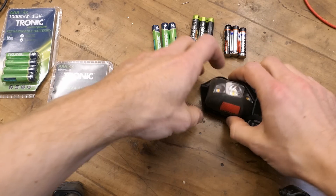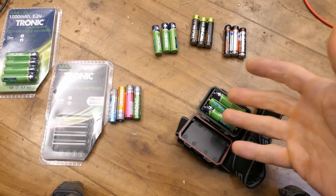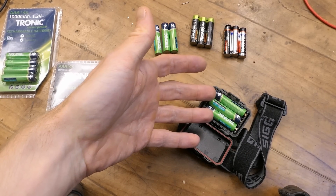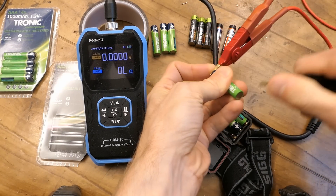A lower voltage drop LED draws more current, of course. And the internal resistance of the battery has a huge effect here because it's a big part of the current-limiting resistance. That internal resistance depends on the state of deterioration, type, and state of charge of the battery.